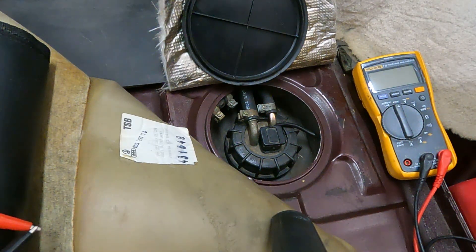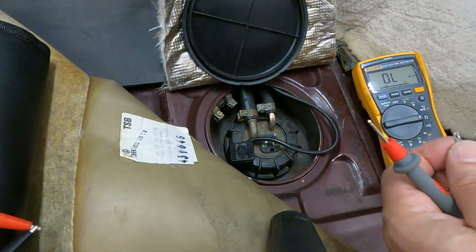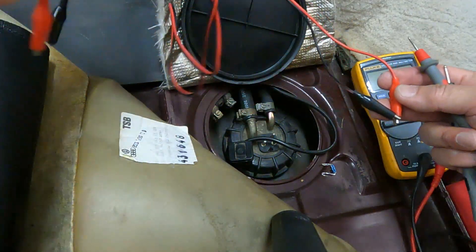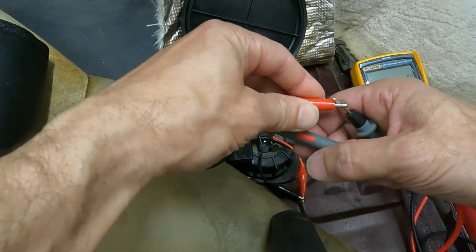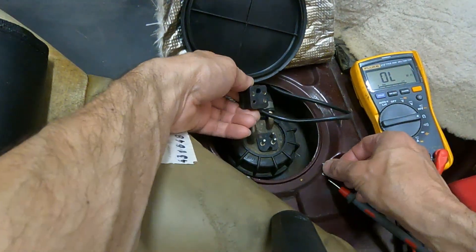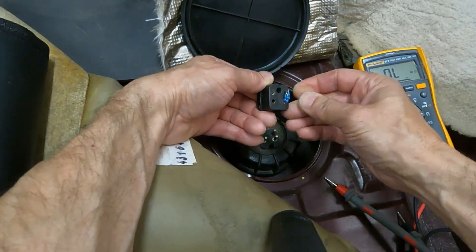I'm going to give it one more shot. Let's first test the system — it's supposed to be 2.8 ohms at the top. I've got four 10-ohm resistors in parallel that I'm going to put across here, so that should be 2.5 ohms. It's reading pretty good — 0.1 ohms across the leads, 2.6 plus the lead, so it's right at 2.5. I first tried it with a set of alligator clips and questioned that because there's some resistance in those clips. Those clip leads showed one and a half ohms, so best not to use those. We'll take the resistors and put them right into the connector.